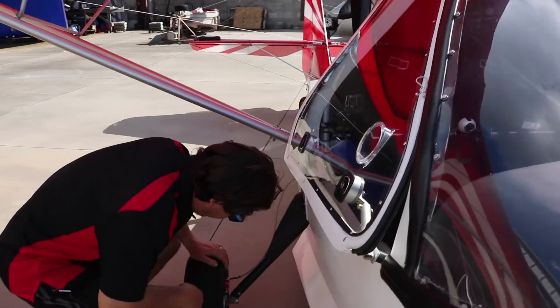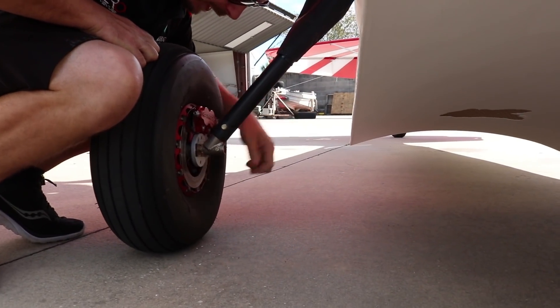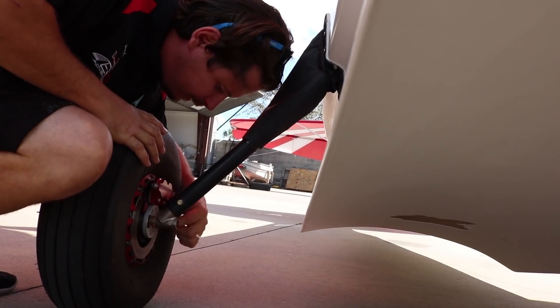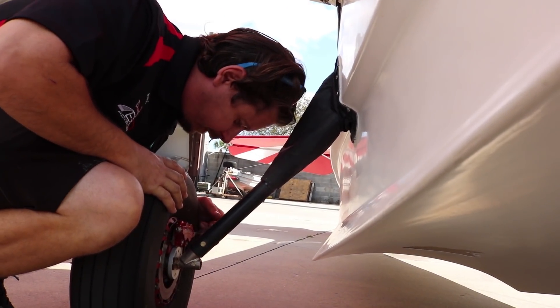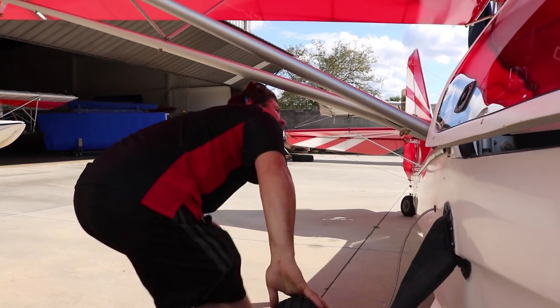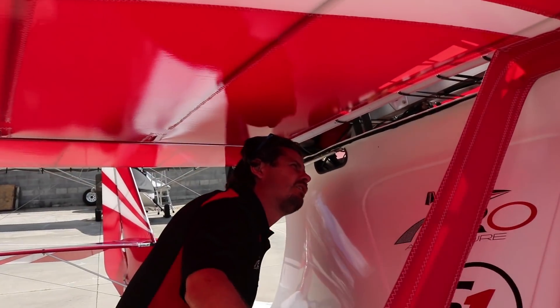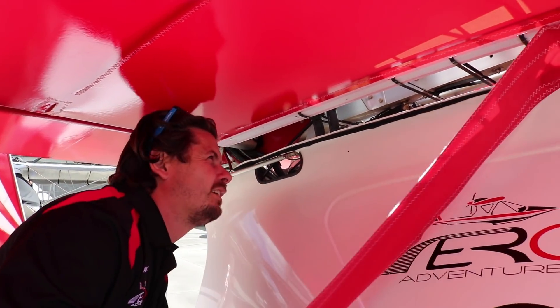We'll come down and inspect the wheel on this side. We have our spindle housing — no cracks in the welds, everything looks good. Our brake looks good too, with the safety wire still connected all the way around. This plane does have really good braking, which is a nice plus. And then I'll inspect all the way front and back — everything's attached and no fraying.